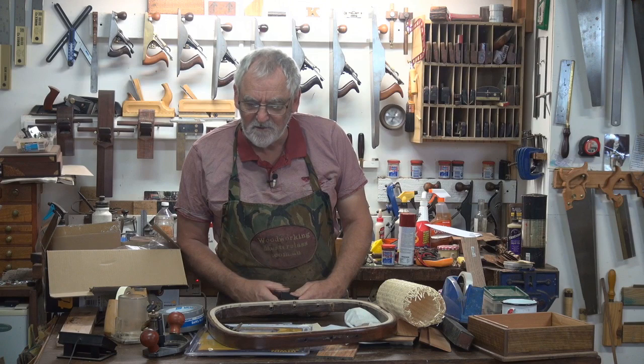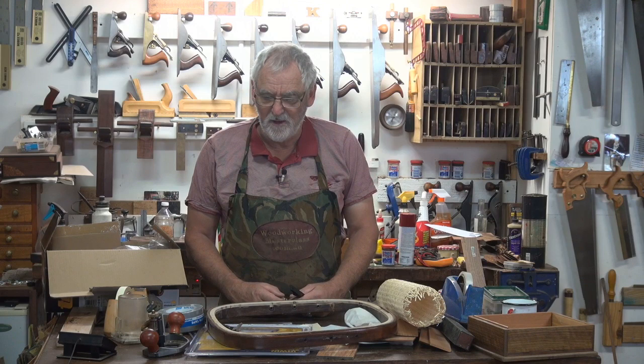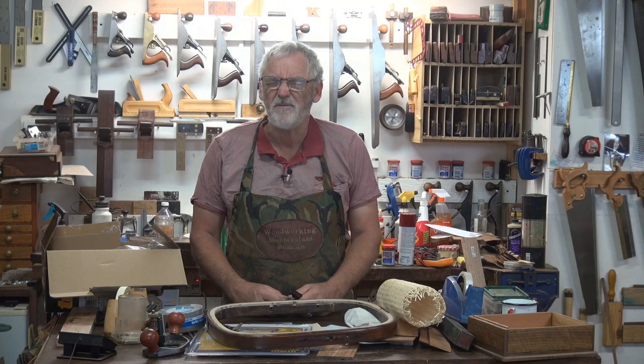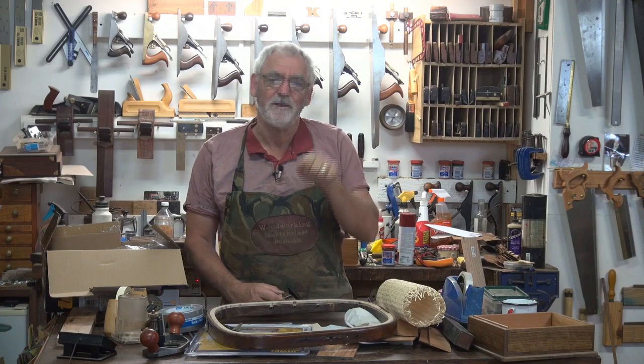Right, I forgot to ask yesterday with the hollow plane, what was the dowel size? I just used 3/8 dowel, mate. If you had a smaller dowel, you could go maybe 5/16 and allow for the paper, but honestly, it's not going to make that much difference. You pull it tight, that's all you'll need.